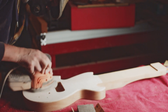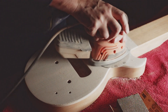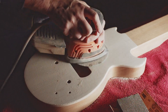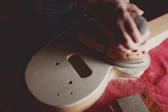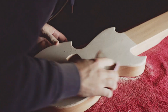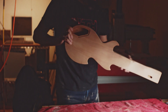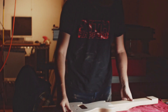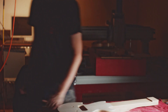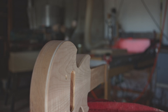After completing most of the work on the edges, I have one final piece of edge work to do. It involves the edges that need to remain sharp and crisp. Even these edges have a tiny edge break, and it may be tempting to knock them off, but it's best to wait. It's a good idea to keep them sharp for as long as possible and only break them as a last step before finishing. This method ensures the sharp edges that define the shape of the instrument remain as clean and crisp as possible. You can achieve surprisingly different results by considering the order of operations and giving it just a little bit of thought.